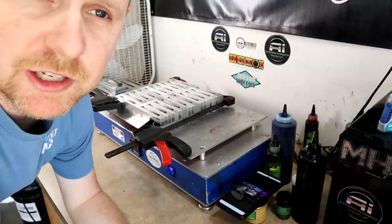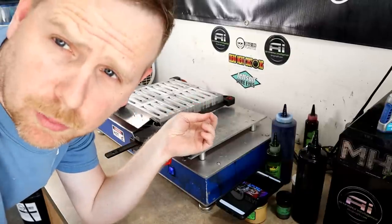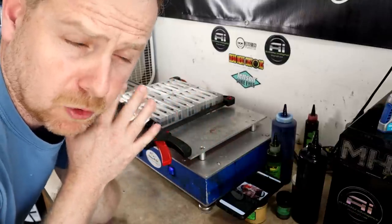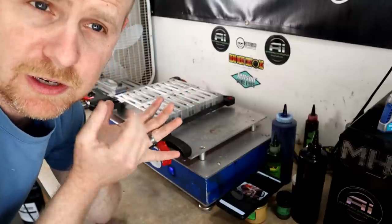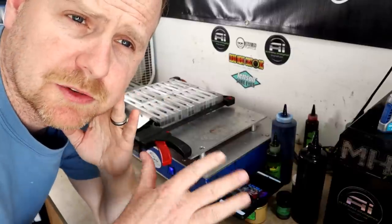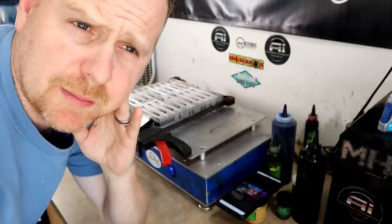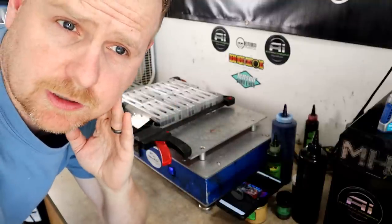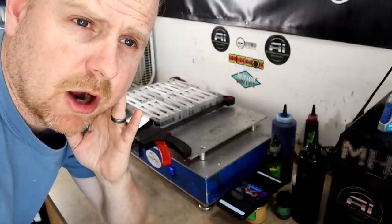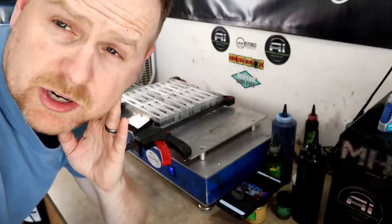So we might actually cheat here and cut rolling while we're just waiting on the molds to get to full temperature. There's really no point in filming just time where we're doing completely nothing. These are at 205 degrees. I want to pour them at about 270, 275. So we might cut a little time out here just so that y'all aren't watching completely nothing. But I would say we probably have 10 or 15 minutes left of preheat time.